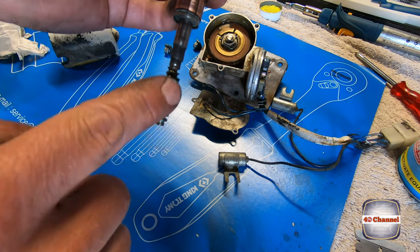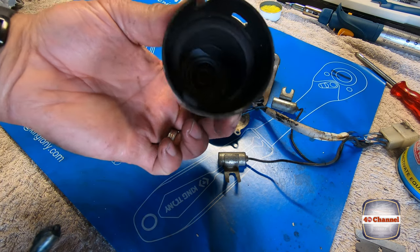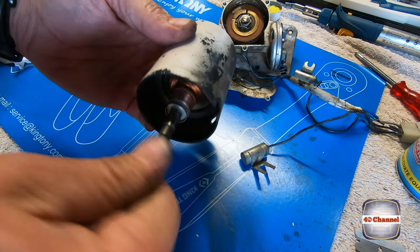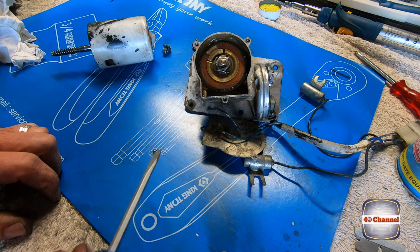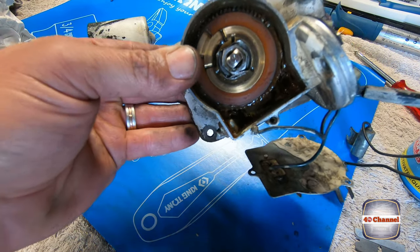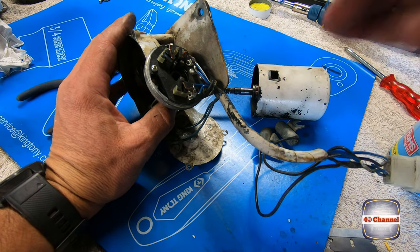Just going to put a little bit of grease on the back end here. We'll grease up the worm drive and the little ball bearing — that'll sit in there nicely and the grease will hold it in place. Now it's got a pretty strong magnet in here, so we have to fight the magnet to send it in place. Then work it around a bit to get that grease worked in and make sure it's sitting in nicely. Using a screwdriver that's a bit magnetic always helps a lot. That bearing's in place. Now that we've cleaned everything out, we need to slide this all back in place.